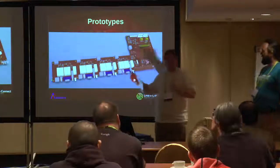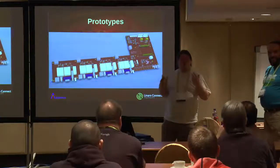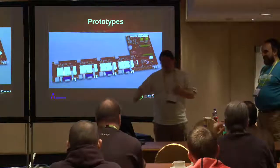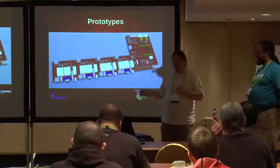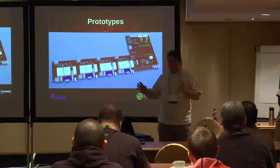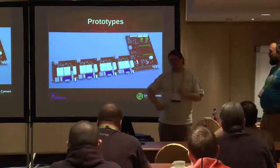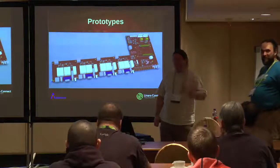The limitations here: this is a pull to ground. So if you are on a 12-volt board, most of the switches typically are pull to ground. You'll have to check. IO on here is 12-volt tolerant, i.e. I can pull it to ground and I don't care if you give me 12 volts. It's not going to blow anything up, but I can't output. So it's active low only, I'm afraid.